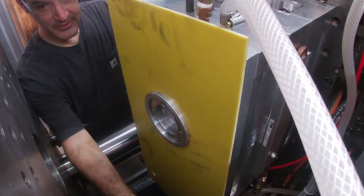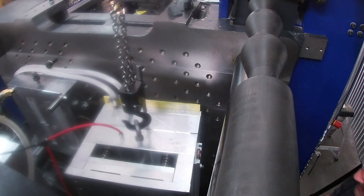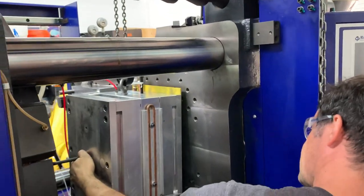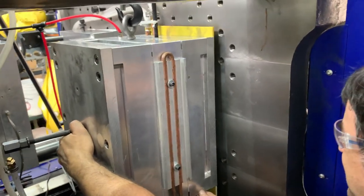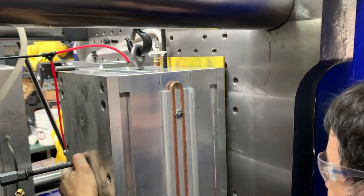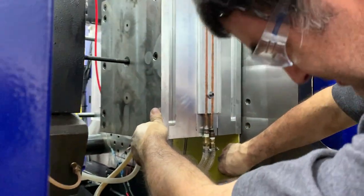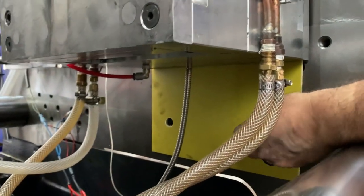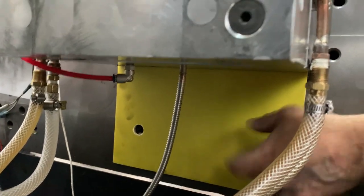All right. And I am going to pull the gantry crane over. It's good to have multiple angles. Okay. So, yeah, we'll push this some more. Bring the mold right up, and then we'll align our alignment ring to the molding machine platform. Like that. Now we got a heat spacer. And if I machine this spacer correctly, then these bolts down here will hold the spacer against the platen for future loading of molds, but I probably do need to put a bunch of washers on it.